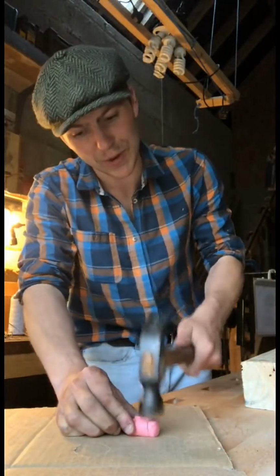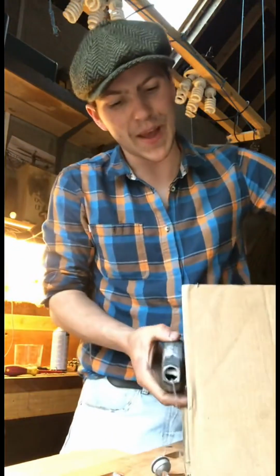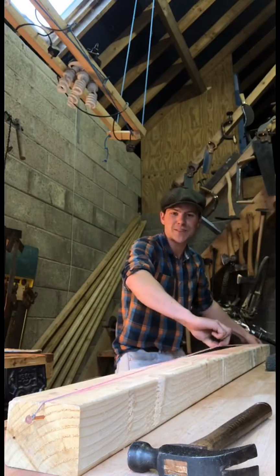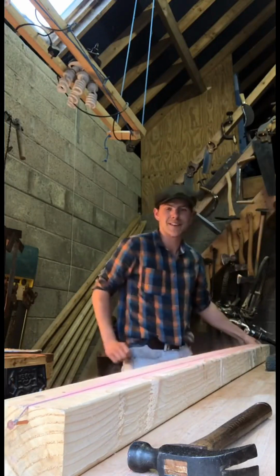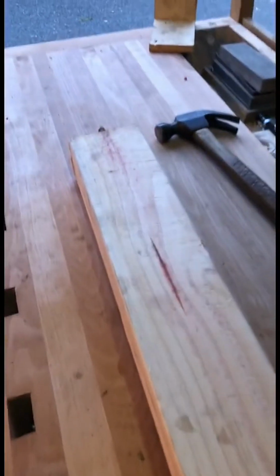And then we'll just use the hammer to crush up the chalk. Turns out as well we can just screw off the top and then pour in our chalk. Then when we have it in tension, I'm just going to lift it in the middle and just... So we can see there the high patches have been marked out almost the whole way along the wood.